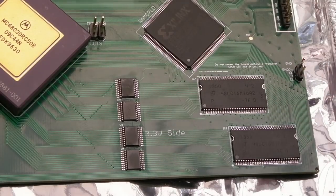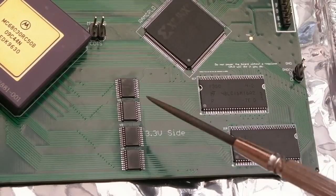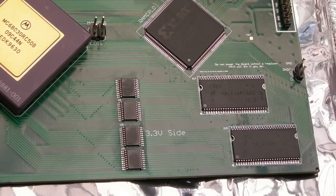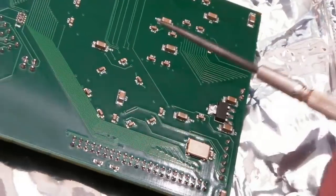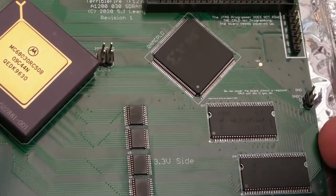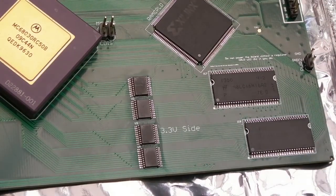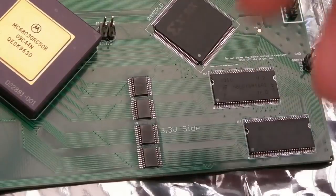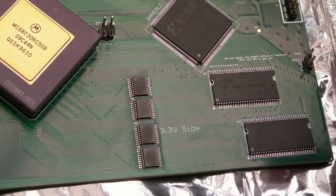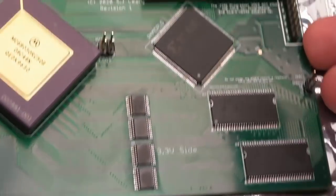And if you're interested in pricing for something like this, if you wanted to build one yourself, I think Pillock last night said on JLCPCB you could get 10 of the PCBs for £62, roughly. Now, I think that included the underneath here pre-assembled, like this one was, which is really nice because that takes most of the work and effort out. So if you imagine, what's that, about £7-ish for a PCB? If you were to buy it from a seller, it might be £10 or £12 for a bare PCB. And then the actual cost of the components and the chips and stuff, you're probably looking at £60 to £70-ish. So I would suggest something like this you could build yourself for around the £80 mark.